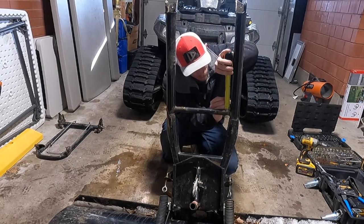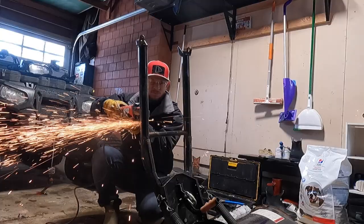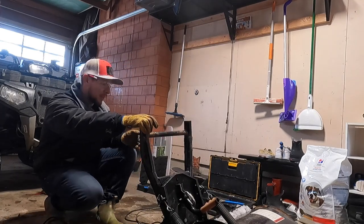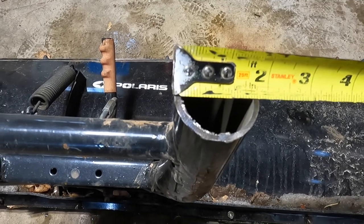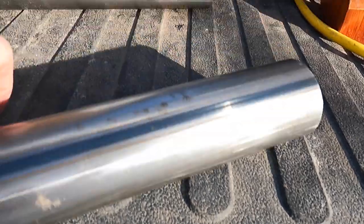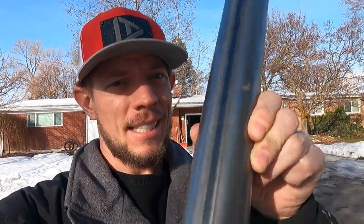We're not building a watch, so now we can cut. I don't have an extension cord — holy cannoli. This better work or we're going to be in big trouble. Now we can take a measurement: that is an inch and three quarters, and that's what we want the inner diameter of our new pipe to be. I went and picked up some pipe at a local fabrication shop. The cool part is they'll sell by the foot — some places make you buy a 20-foot stick, which would be a hundred bucks. So they sell it pretty cheap, and they cut it for me so both pieces are identical lengths.